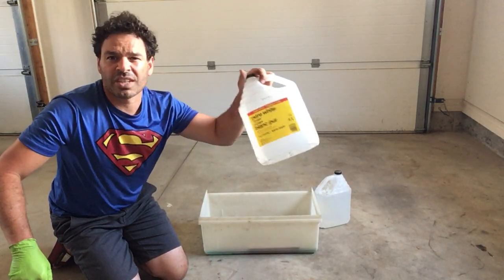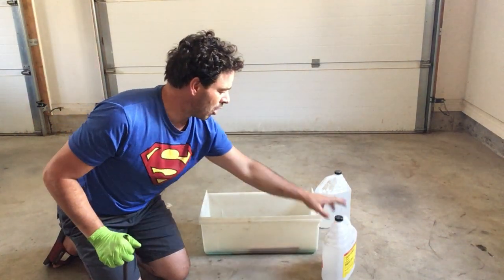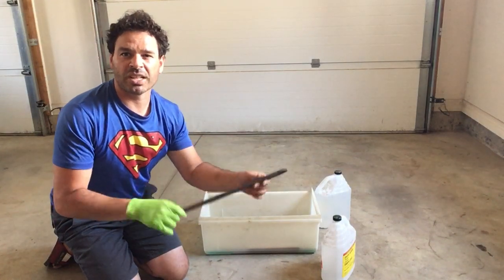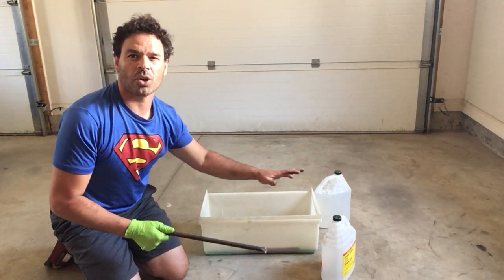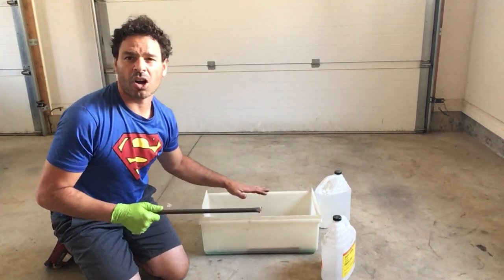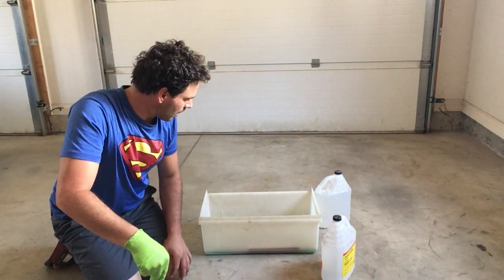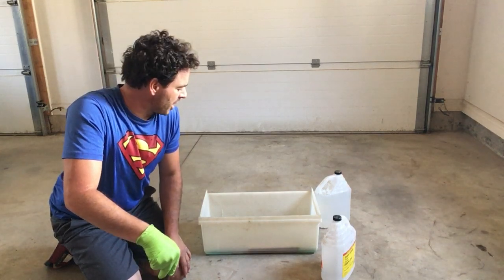Either way, I'm going to see if I can clean it up using this vinegar. I bought it at a grocery store — it's only 5% acid and this jug cost me 99 cents. All I do is pour it in and let it soak. Once it's soaked, I rinse the pipes with water and then throw baking soda on it to neutralize it. If you don't put baking soda on it, it will still have some acidity and you will see a reaction if you are storing it.